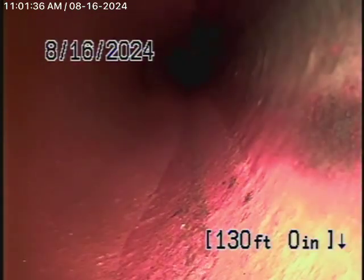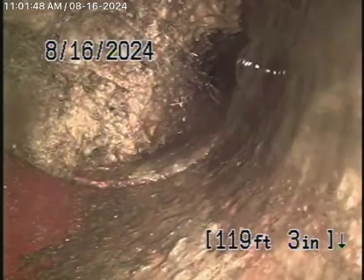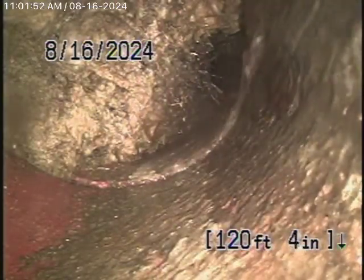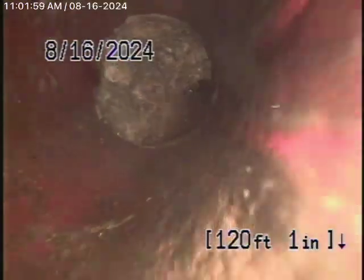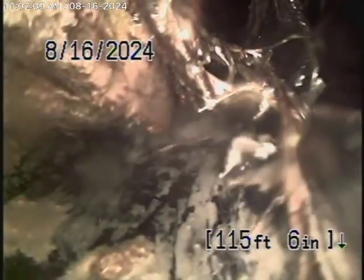This all looks pretty good. Right over here, underneath the parkway, there are very heavy roots in the sewer line in the 6-inch clay pipe. You have those trees out in the front — they're very aggressive trees, that's why you're going to have a lot of roots. They really got into some pretty heavy roots over here.